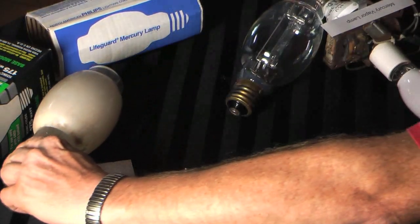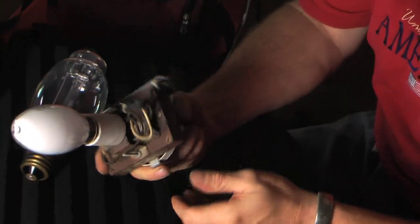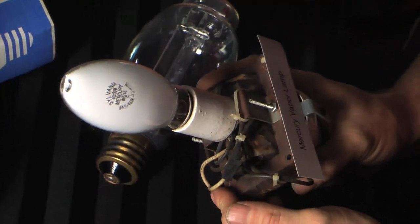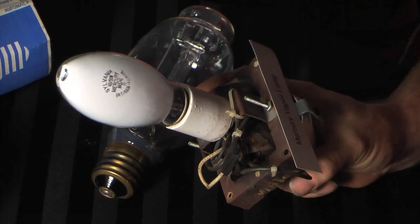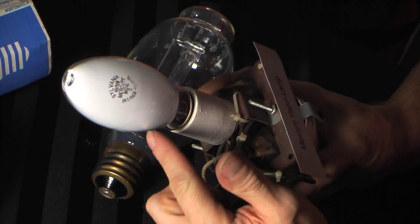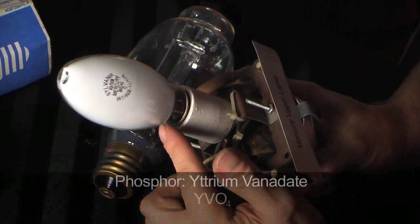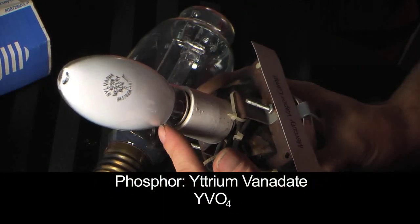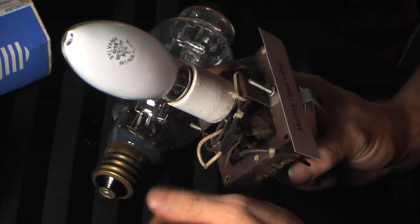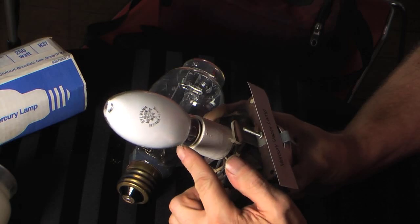There's a later type here in a smaller wattage, with the auxiliary gear to run it — the ballast. This one is a 50-watt mercury vapor, which is the smallest size they ever made; it can run on either 40 or 50 watts depending on the ballast. The phosphor on this lamp is a whiter color because it's a different phosphor — an yttrium vanadate phosphor, which is actually a type of rare earth phosphor. This phosphor is much more efficient than the old C phosphor, and it not only improves the color of the light but also increases the light output.